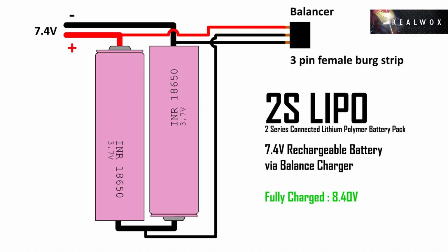The materials required are mentioned in the description. The two batteries, each of 3.7 volts, are connected in series, which makes the total voltage of the battery pack 7.4 volts, and it would be around 8.4 volts when fully charged. Anyways, without wasting any time, let's start building it.